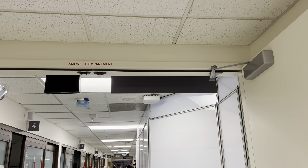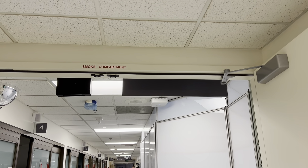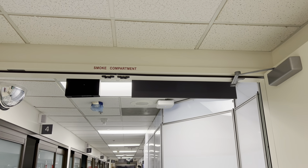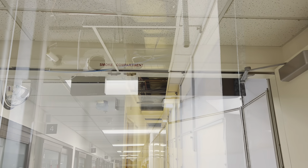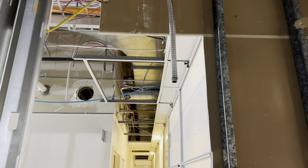From there, outside of those double doors, we have to go down this whole hallway — as you can see the double doors down there. So we're working our way backwards. Had to put the bridle rings all the way down this hallway. Luckily there was a cable tray there so we just attached to that. On the other side of that containment, which you just saw, is this room.